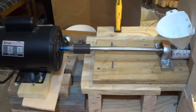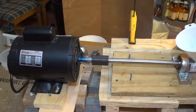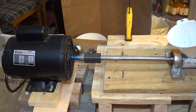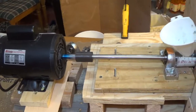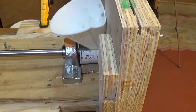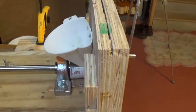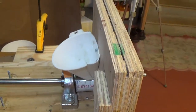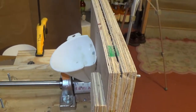We're using a 3,450 RPM half-horsepower motor — could be less, could be more. With a rigid coupler, we've removed that second bearing, so now you've just bought one bearing. We're using that little feed system, and I was pouring through it a good 100 pounds an hour.